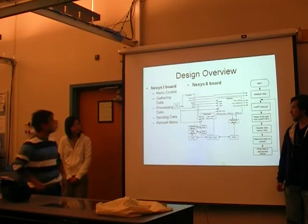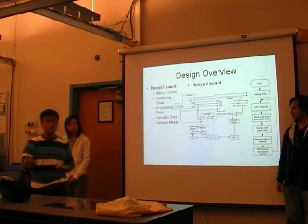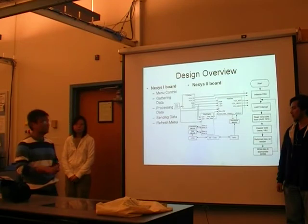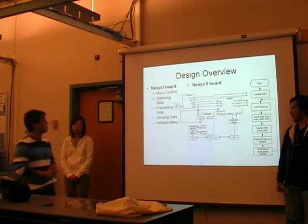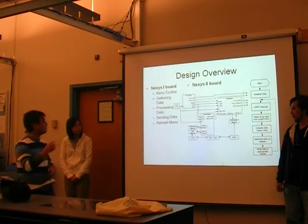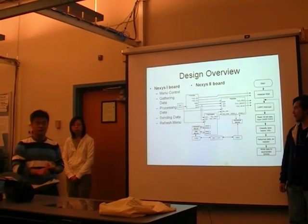And for the gathering data part, we accept any source such as a battery or function generator for the input data. And it works for any regular waveforms such as sine waveform, square waveform, and other waveforms. It will gather 512 data points, and it will automatically start. And then it will take those data to calculate frequency, amplitude, period, and other information that we need.